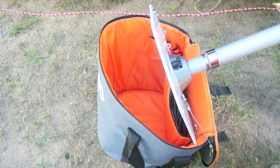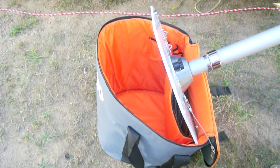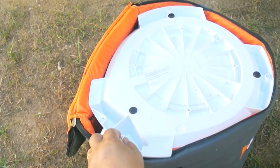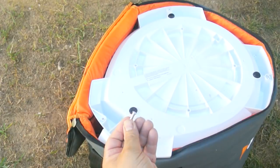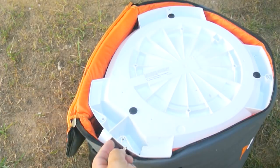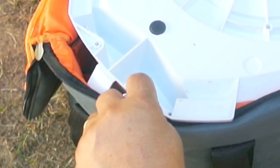The concept of being tool-less might be more of an idea rather than actual practice, because once we get all these on we're going to go around and give them a quick tightening — we've just snugged everything together. The base of the satellite has four holes and they accept 3/16-inch diameter hardware. These are clevis pins, and it's really hard to find the 3/16-inch ones. You may decide to drill these out to a quarter inch, because you can find those all over — bimini tops for boats and things all use quarter inch. But if you drill those out, I would recommend pouring that void full of the black epoxy like we did the top, and then when you drill it out you won't weaken it any.